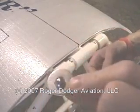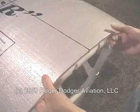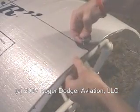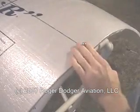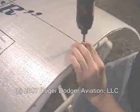Use the 1-inch self-drilling screws to hold the styrene in place. Also use the 1-inch fender washers — the screws won't work by themselves. We're drilling this first screw at the back of the tail assembly in the center. This is a method for holding the styrene panel in place while we glue it. We tried using masking tape, but that didn't work because the tape peeled off the plastic lamination when we removed it.